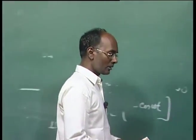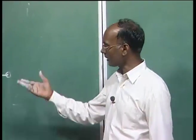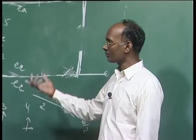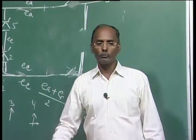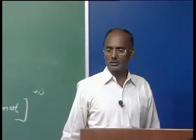During the whole process, no doubt we are injecting a lot of harmonics in the DC side as well as the AC side, because the currents change pattern, it is not a systematic pattern in the phases. So during this time we are introducing some uncharacteristic harmonics as well, but the magnitude is not very significant. And since it is required, we have to go for this. There is no other option.